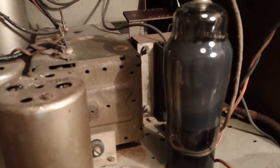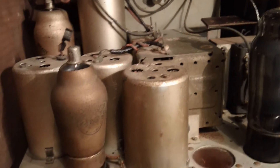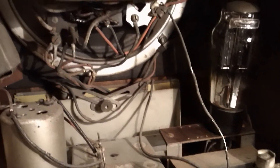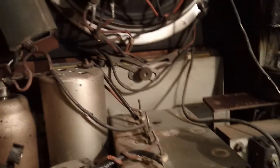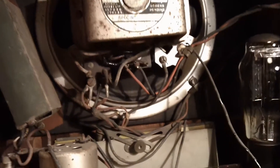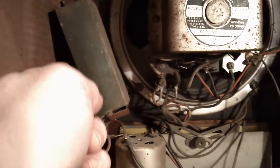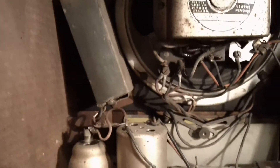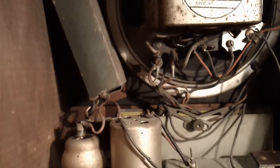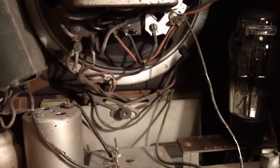So, Pen 4DD there — quite a nice little set. I've just had a quick poke around it, checking all the inductance measurements and things and it seems to be okay. Sometimes you get a radio and you get all enthusiastic about repairing it, and you find the mains energising coil for the speaker is open circuit — but it seems okay. It's got the electrolytics here in this cardboard packet, which might be quite challenging to undo. It looks as if that tab should pull straight out, but I guess that's glued in. I think I have a lot of rewiring ahead of me.